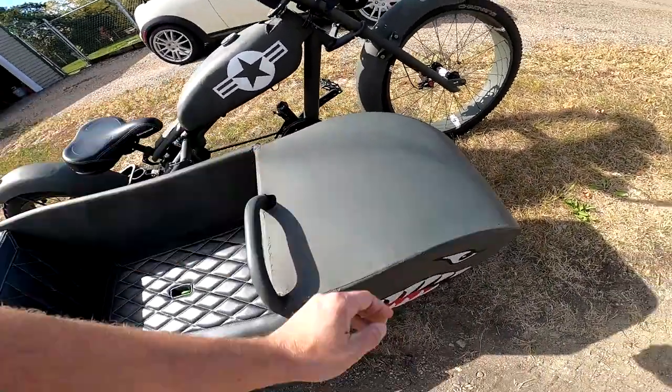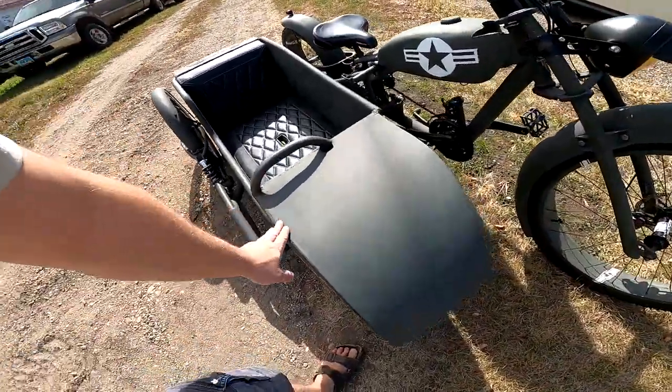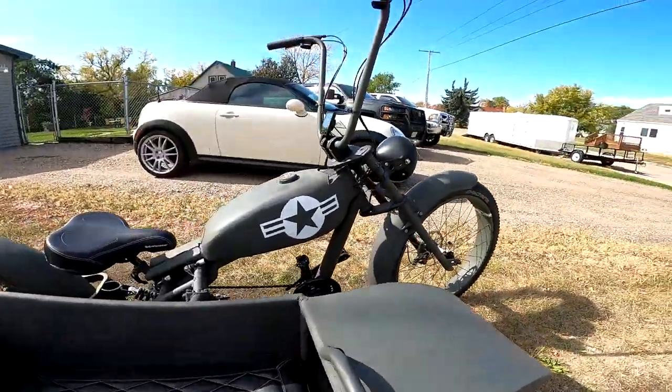water heater skin, the outer skin. I stripped it off and tack welded it all together, cut it, formed it. And just tack welded it. Again, it was all with my flux core, so you can see the little tabs in there. I kind of drilled them out and did almost like spot welds.